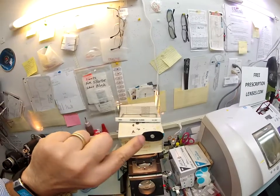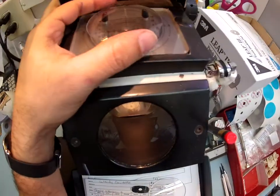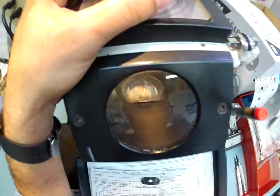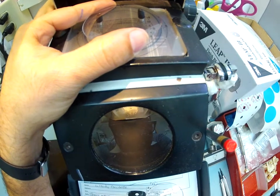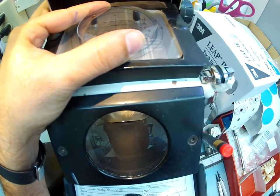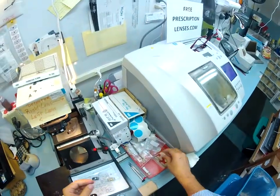This block is what's going to hold the lens in place while it is cutting. I'm going to put that there and apply a double-sided sticky pad — the black side is the sticky side. I'll stick that on the block and pull away the tape to reveal the sticky side. Now I'm lining everything up in the crosshairs of the scope, going three millimeters up, and placing the block on the lens. You are stuck on the lens — let's do the same thing for the left lens.